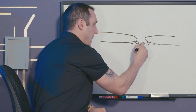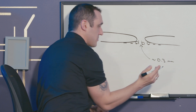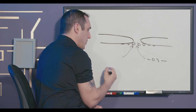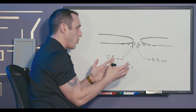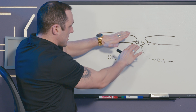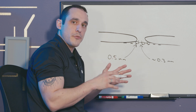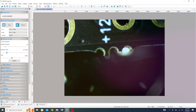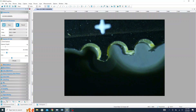The hole edge-to-hole edge spacing is going to be about 0.3 millimeters, and the hole diameter can be for example 0.5 millimeters. These are just typical examples, not hard requirements. Once this is broken off you're going to have little pieces of material left over in between these holes. Here in this microscope image we're looking at detached mouse bites along the edge of a test circuit board. You can see some of the material left over and even the curvature of the drill hole. This is pretty typical — you'll usually file that down so the edge is smooth.